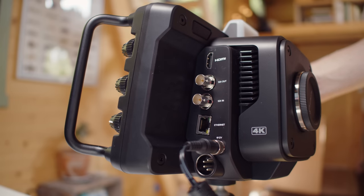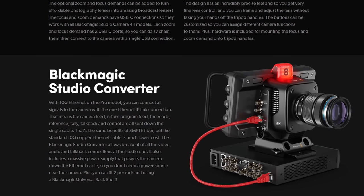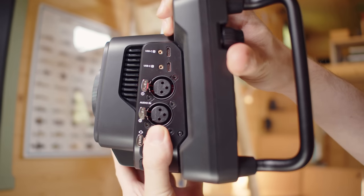The SDI input and output workflow is really interesting. My older ATEM Television Studio HD has SDI inputs and outputs and talkback to and from the camera operator — I'll dig into that in my next video. A completely different workflow is that ethernet port. Using it in combination with the currently unavailable Blackmagic Studio Converter allows you to send program, video signals, and talkback all through one ethernet cable. When I get the studio converter I'd love to make a video about that single-cable operation. It's also really good to see full-size XLR inputs on the Pro model — for many gigs I've wanted to send audio in through the camera in sync with video, and many venues have XLR outputs on their audio consoles, so XLR inputs are a must-have.